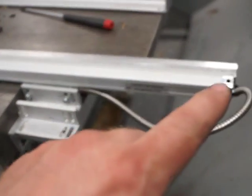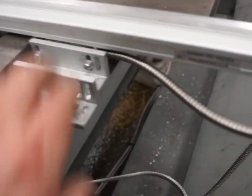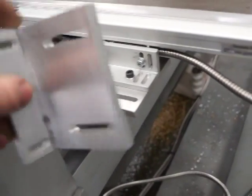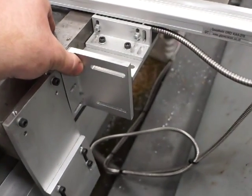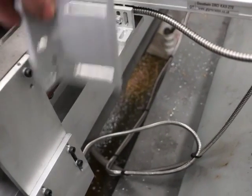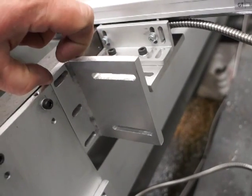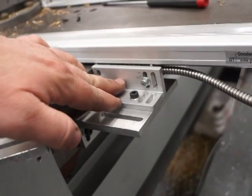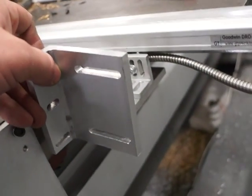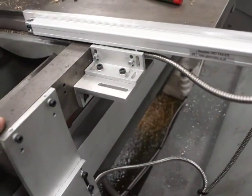Once that bracket is fastened on, you attach the second one in a suitable place — this depends on where you've put the scale itself, as to where you'd actually drill through and bolt. There's an alternative method: you can mount this bracket on the carriage, bolt through into the carriage at two points, and then bolt through to the reader head behind there to fasten it securely. That one bracket then takes the place of those two.